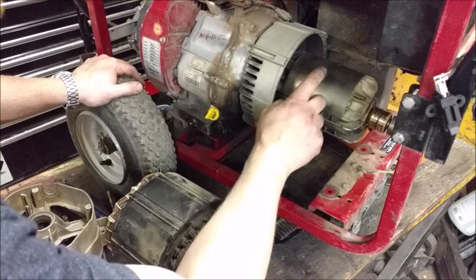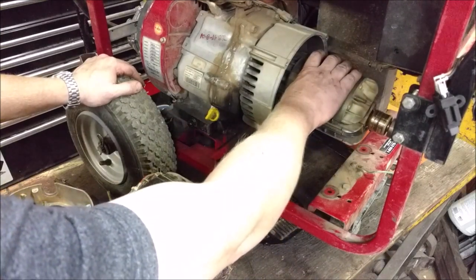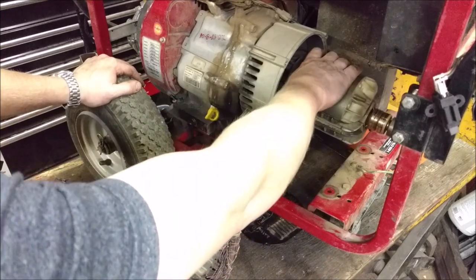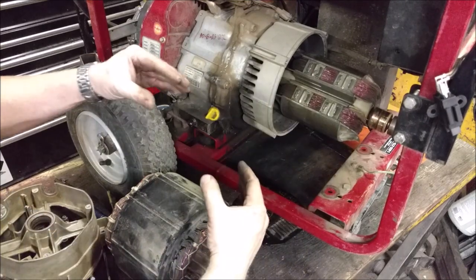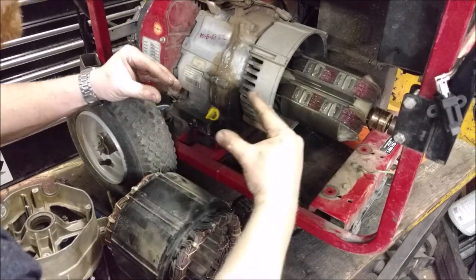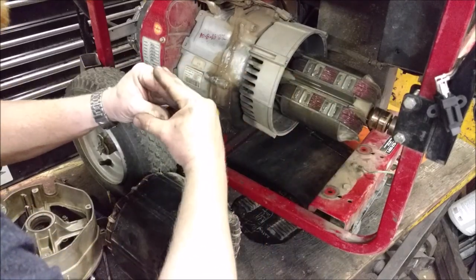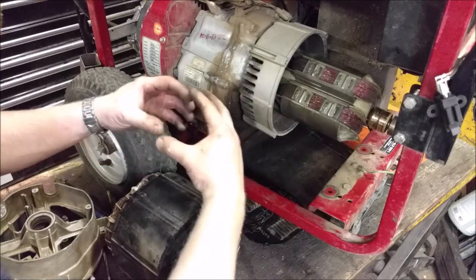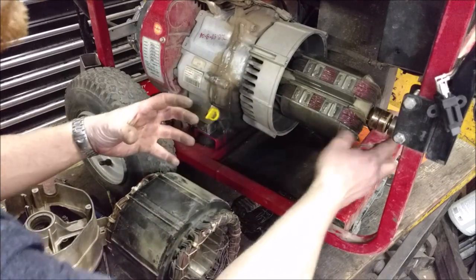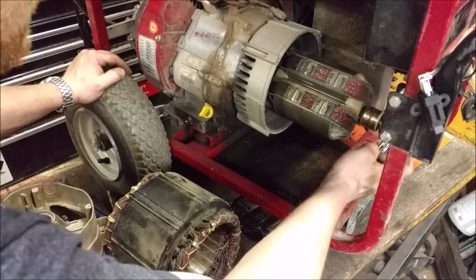It is on a tapered shaft — what they call a J609B shaft on the engine — and this is pressed on it on a taper so it always stays perfectly centered. It doesn't take much force to actually clamp it on, and it stays on there without any wobble. If it was just a keyed shaft there would always be a little bit of slop, but the taper shaft makes it firm.